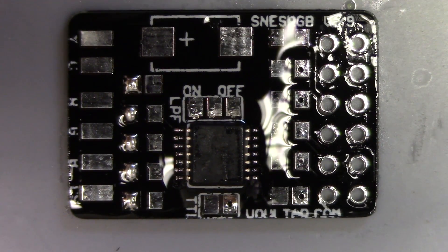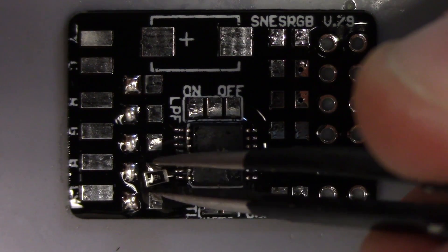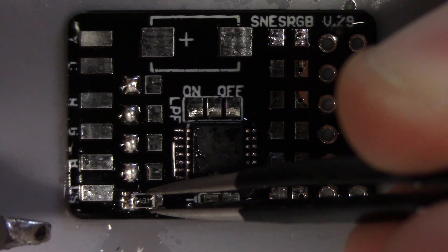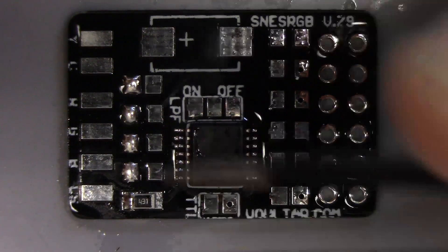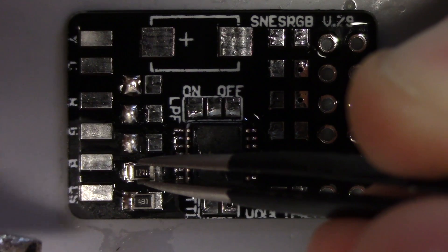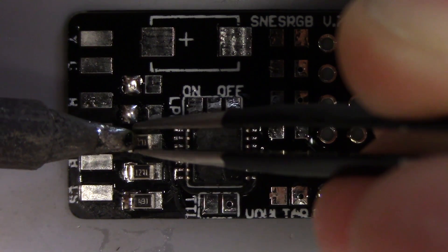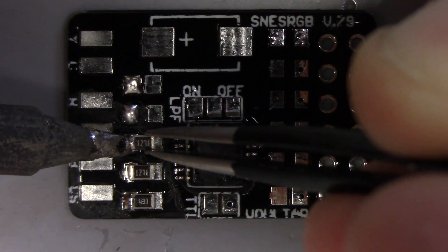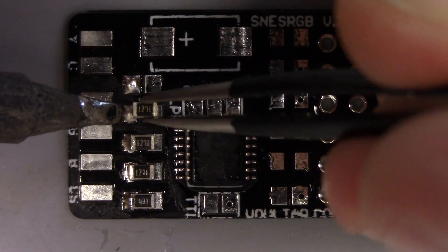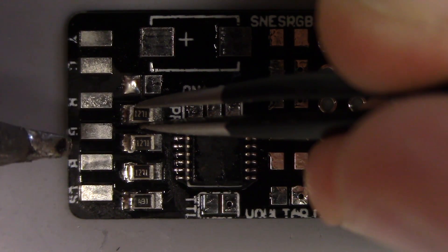So what you're seeing here is I soldered that TSOP 14 package and now I've applied flux to the board and I've soldered one side of the input pads for these passive components. This is all 0805 stuff here. This is always a two-phase process when I'm doing anything by hand. First I'll apply some no-clean liquid flux, then I'll do a tacking method to position the components to the landings so I get good orientation and good placement on the pad. That's the first step.